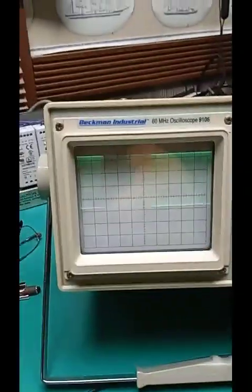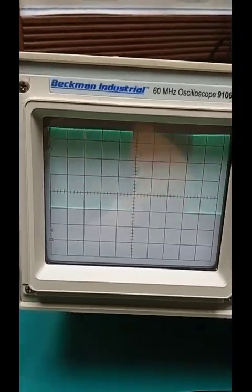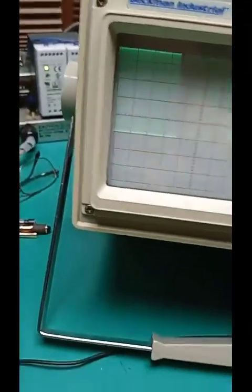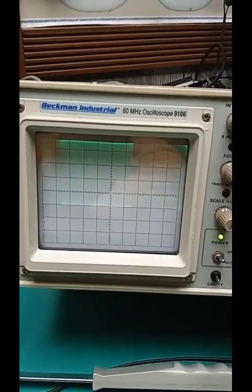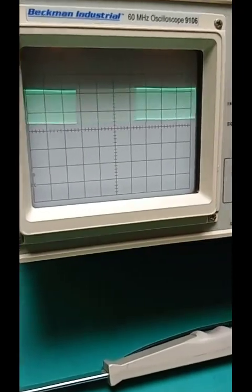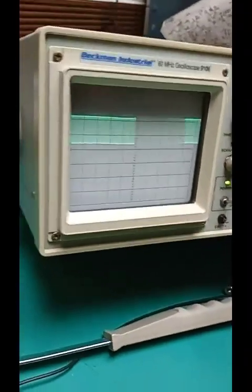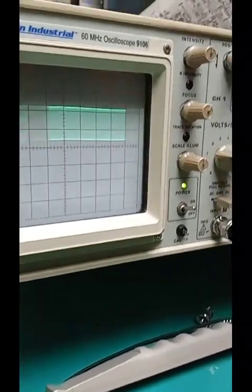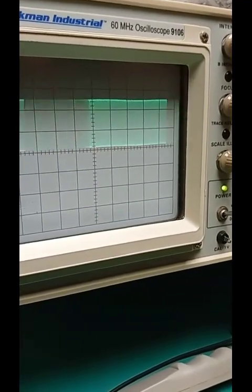And for the other transformer, adjust it also. Nice big signal. Then adjust them both again just to be sure. Then go to 40 meters and set the RF tune at 7. And on top of the chassis, adjust the appropriate transformers for peak. Being extremely careful not to reach around here and stick my hand into the top of the final tubes.